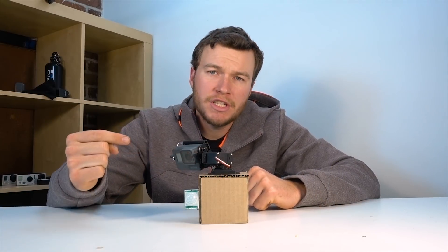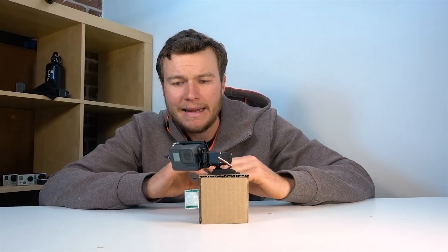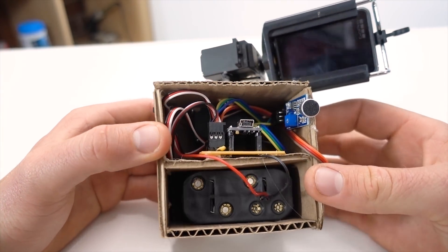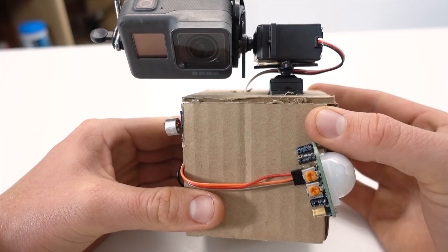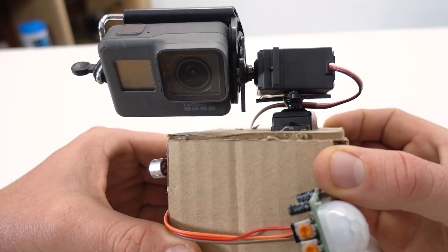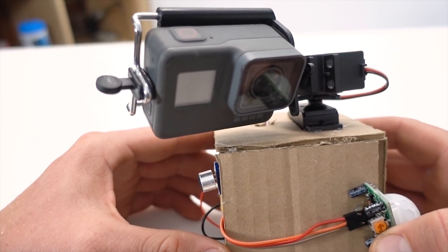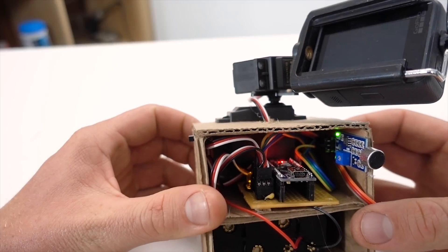There it is — the finished motion-sensing rotating time-lapse base. It's basically a complicated egg timer that will super slowly move your camera around. You can also add in that second servo for a little bit of pan and tilt. The idea was to create something smart: rather than just a motorized time-lapse rotator using a servo or stepper motor, this one freezes wherever motion stops when you walk off for lunch and doesn't start again until somebody comes back into the room.